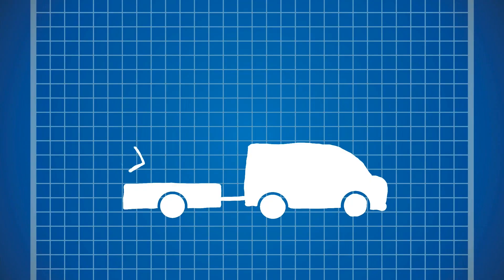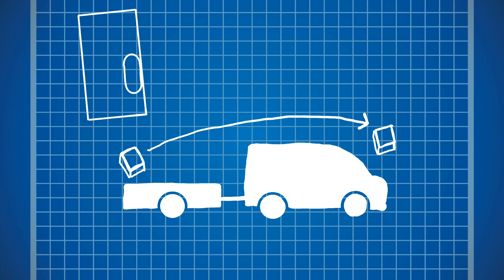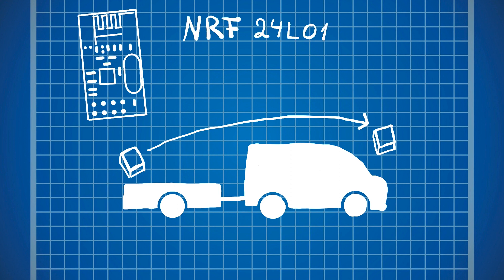So we're building a sender at the sensor and a receiver in the car. Mike and Chris are going to build two boxes. The first will be attached to the trailer and send signals wirelessly using the NRF24L01 transceiver to the second box inside the car. The transceiver operates on 2.4 GHz — the same band as Wi-Fi — so it should be fine in most parts of the world. But always check your local regulations before you broadcast anything.